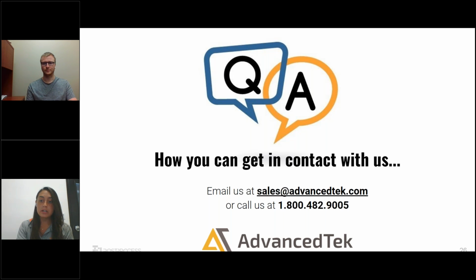I have one here regarding, do you use your DEMI for removing support from other 3D printing technologies other than PolyJet? Okay, so if you saw on that first slide, it mentioned that we have other solutions for other technologies. Specifically, our DEMI is best used for PolyJet as well as resin removal. If anybody's familiar with SLA, Carbon, DLP, anything like that, the submersion technology works really well for that. You have a separate detergent. So if you wanted to run multiple different technologies in this machine, all you would have to do is clean out that machine and then replace the detergent.